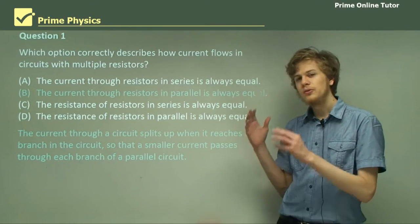Question 2, part B: In a different set of Christmas lights, when one bulb burns out, the other bulbs keep working. Are the bulbs in series or in parallel? We know it can't be series, because in series, if one bulb stops working, the others have to stop too. So the answer must be in parallel. If we build a parallel circuit and one branch breaks, the rest of the wires still form a perfectly good parallel circuit. So the bulbs must be connected in parallel, because reducing the current to zero in one bulb does not reduce the current in all the other bulbs.